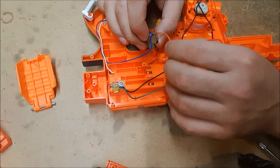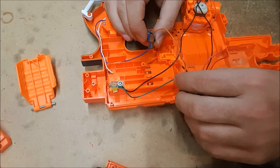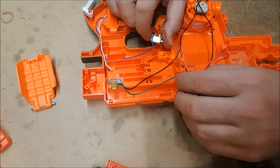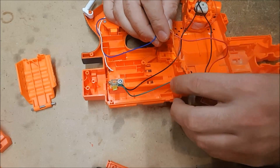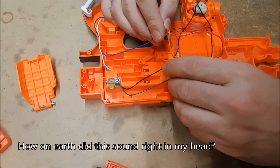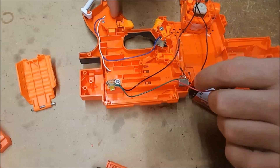We would do the same thing here. This one only has two positions — it either connects or it doesn't connect; it's a simpler switch. This is completing the positive circuit. You would need to connect first to the far side to make sure it's not the cable that's the problem, and then complete this switch. Then go to the far side and connect your battery to that, press both switches, and if it connects, then you know it's good. If the motors spin when you test both of those, we move back to the next switch.